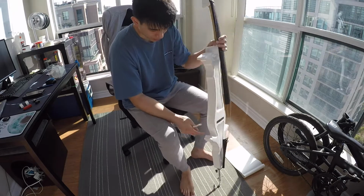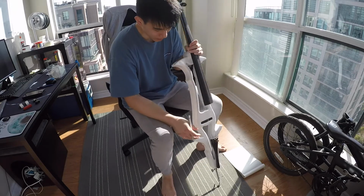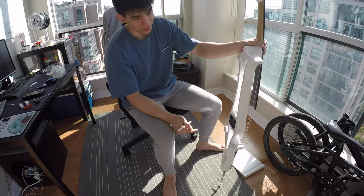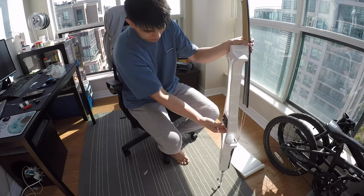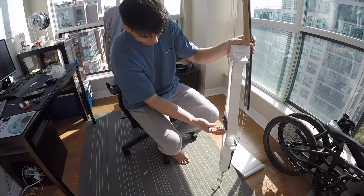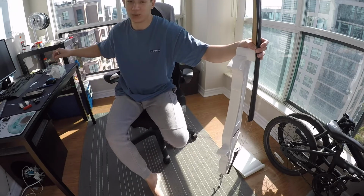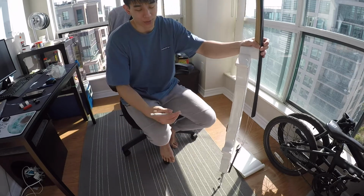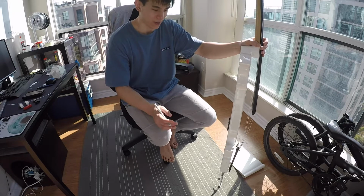I think this is a perfect spot to leave it, and that is where I'm going to do it. Okay? Now, the bottom over here, I do want the wings. That's going to be a little more difficult. The other Yamaha has the wings as a metal piece that is screwed onto the back. There's nothing really to screw on over here, so that is already going to be problem number one. And also considering the fact that I have a Prusa, and the Prusa's diameter is around 220 millimeters, it's going to be a little tough. It has to be coming in parts, essentially.